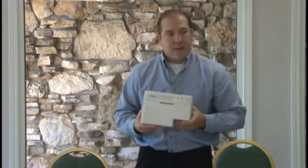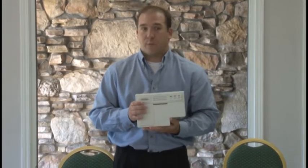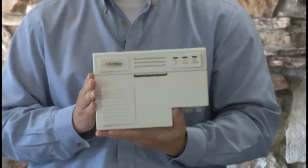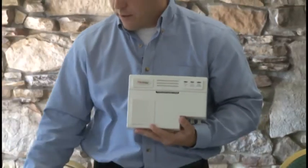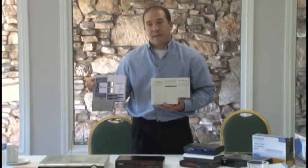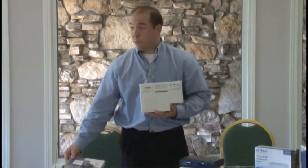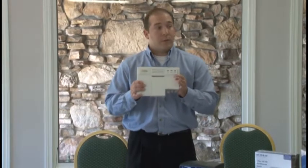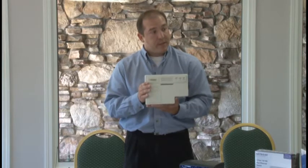We spoke about this earlier. This is the battery backup that will be in a customer's house. Why do we need this? DSL runs over our copper wire — we can deliver voltage across our copper wires and still allow that customer's telephone to ring in the event of a power outage. Unfortunately, fiber is different in that regard. This is the ONT that's going to be on the outside of a customer's house that needs to be powered to deliver that light signal to and from our remote equipment stations. This battery backup keeps that customer's tethered telephone powered up for between 8 and 12 hours.